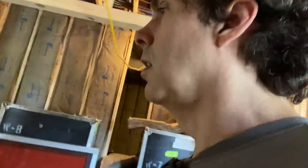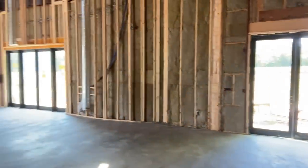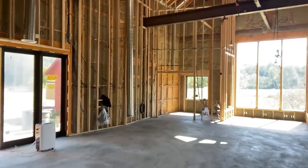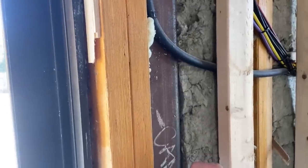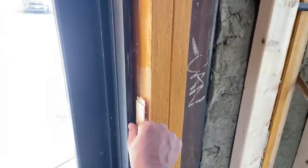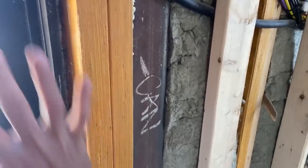This is kind of cool — I had a video of this going in, so you'll probably have seen that. But here is the finished new concrete floor in the big room. You can kind of get a sense of where things are at in here. This is in the same spot where the insulation has gone in, and we're getting ready for the sheetrock to go up. That's going to start next week. We're going to have a 26-foot scissor lift for the team doing the sheetrock. And yesterday I was finishing doing all this shimming around the doors because we want to have the sheetrock come and make this turn and come right up with a little 1/8-inch reveal on this door frame. It'll come up, make the turn, and then it'll just be sheetrock finished out right up to this thing — so we won't have to put a trim piece on it.